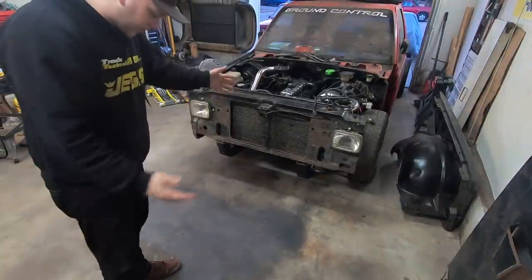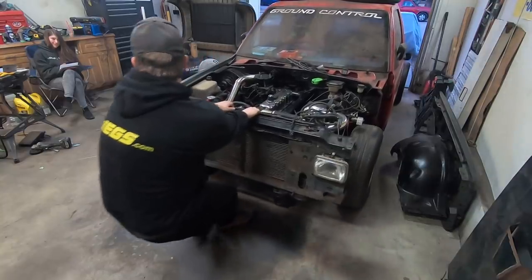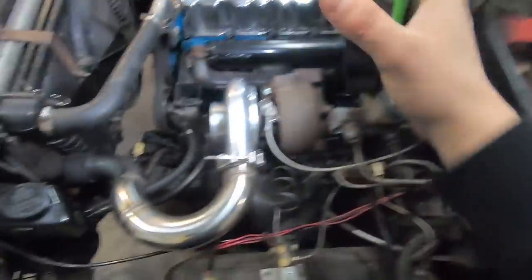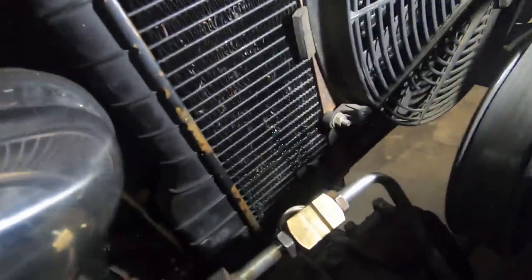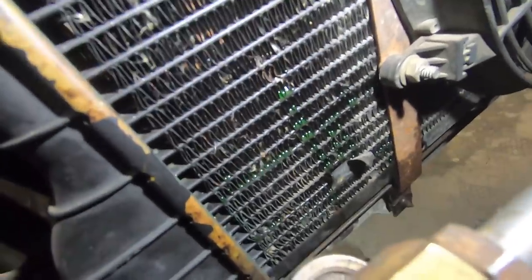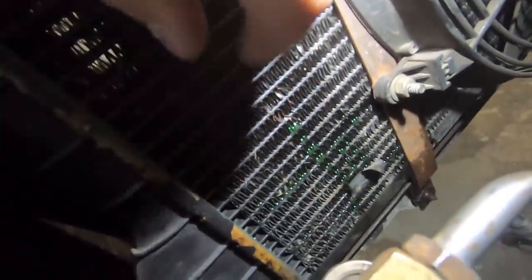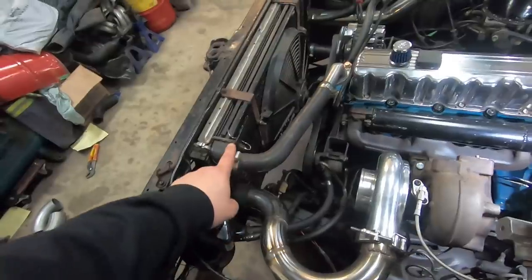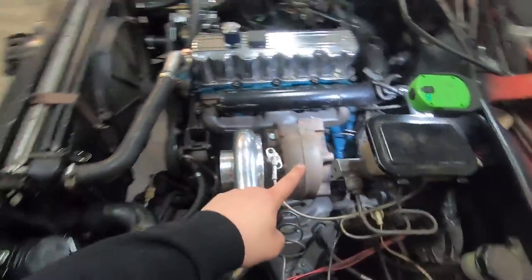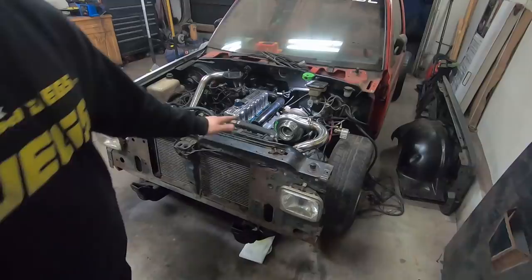You may notice RAT10 is now shoved out of the way and there's a big puddle on the ground. Well, there's a bit of a leak I've discovered. At some point, probably during the power steering work, something jammed itself into the radiator — the coolant is actually still actively dripping out of it. So that sucks. I'm going to have to take my whole rad out to fix that pinhole. I don't know if I can TIG weld it shut or not, but I'll drain the coolant. I'll sort out the rad eventually, but today's goal is exhaust.